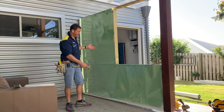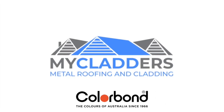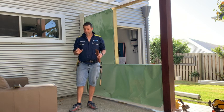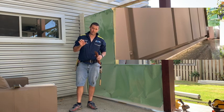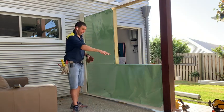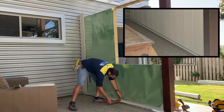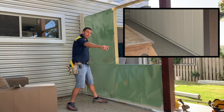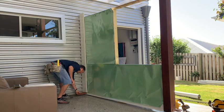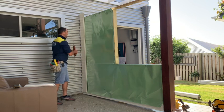Ready to start cladding. We've got our sarking on, we've got our toe mould on, and we'll get into it. With this cladding, we've got a little shadow line built into it — a 20mm gap. What I've got here is a 19mm piece of decking timber left over from my decking. At the bottom, I want to sit this on the bottom of the toe mould and sit the sheet or flashing on top of that to give us that same width along the bottom. I have that first flashing that's going to go in here — and then we get a consistent line to achieve that shadow line look.